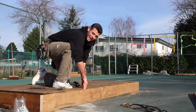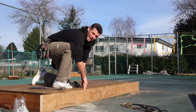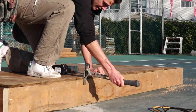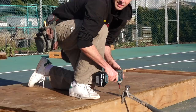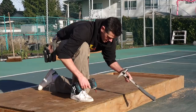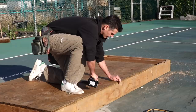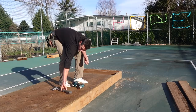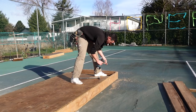This could get pulled out a bit — I'm going to teach you a handy little trick. It's not flush right here; I want it flush. How we're going to do that is using a little bit of leverage — using the head of the screw. With my whole body weight I can easily push it to flush. Carpentry and construction is a lot about learning how to use your tools and get leverage in interesting ways. That was one of my favorite things about getting into construction — learning all these cool little physics tricks to help get your projects to go together.